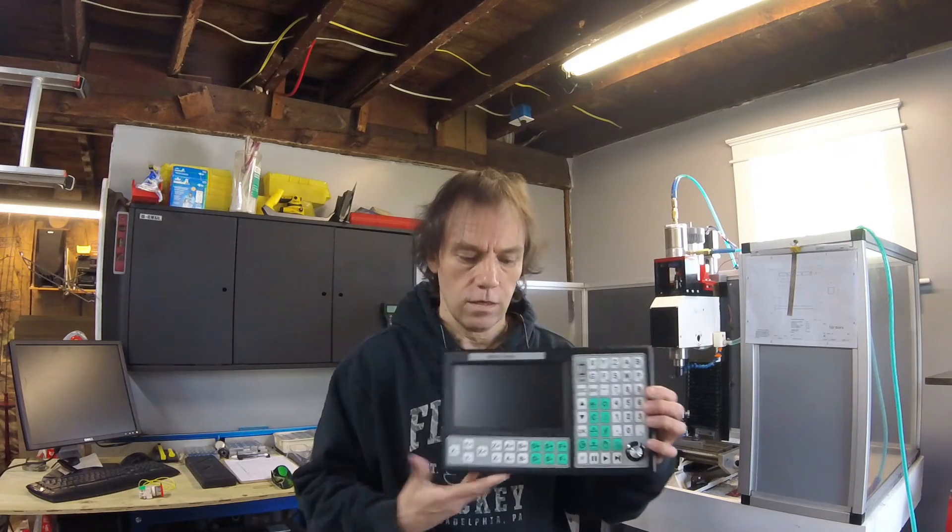Without all of that, I need to pull the whole cabinet out and put it on the bench so I can open it up and work on it. We'll get everything wired in, build our rack, and mount it here. I'll probably move the whole power panel down underneath so I don't have to manipulate a lot of wires, because the longer the wire run the bigger the wire you need — and it all has to be shielded cable. If it isn't shielded, signals pass between cables and the machine won't read right. So the shorter the runs, the better.